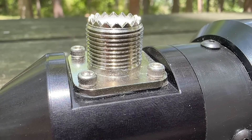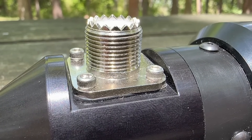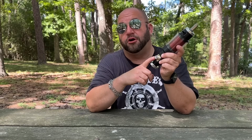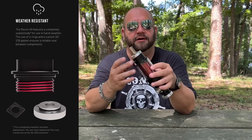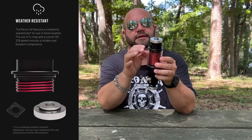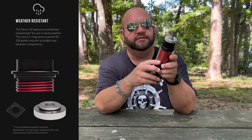I'm going to show you the SWR and bandwidth we get on this in a minute. The SO-239 connector is sealed with a gasket, so this whole antenna is totally weatherproof. You do need to weatherproof your coax if you're going to leave this outside permanently or if it's raining, but other than that there are gaskets on the top and gaskets inside the coil as well — he's done a lot of great work making sure there's no water ingress in this antenna.